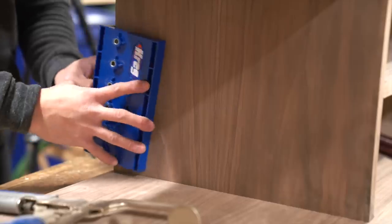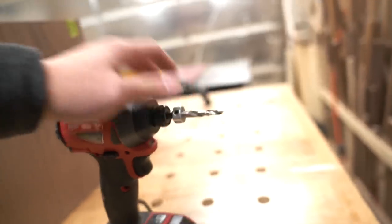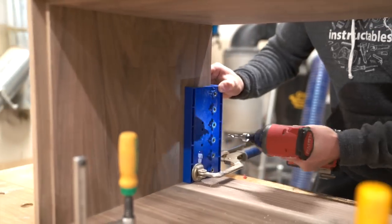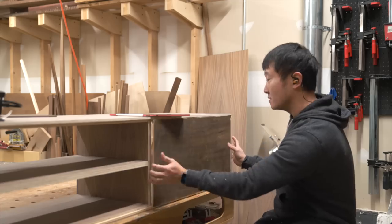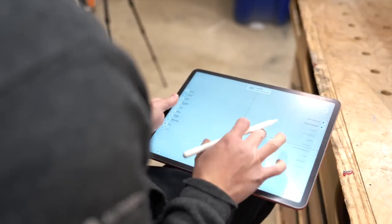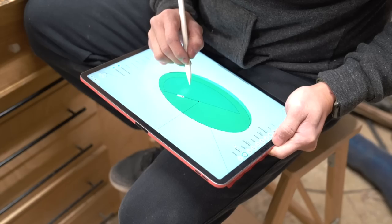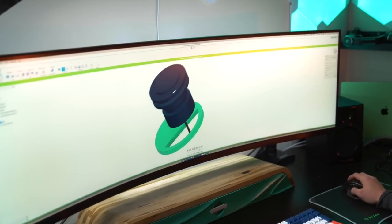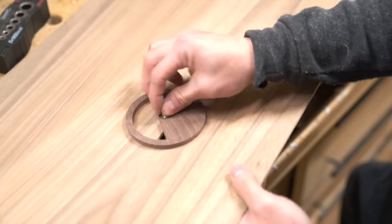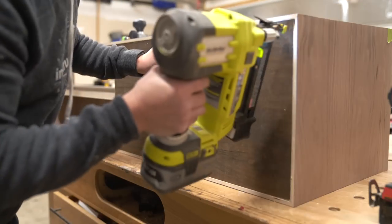And finally, the last thing left to do here is drill some holes for the shelf pins. To do this, I'm going to use this rack jig. Now, before I assemble the back panel, I have to cut a hole for the wires. And if you saw my post on Instagram, you know I designed a little cover on my iPad and then cut it out on my CNC to help cover up that hole if it's not going to be used. Just like that — oh yeah! And now let's attach the back panel to the case with some brad nails.